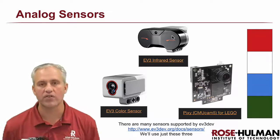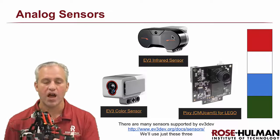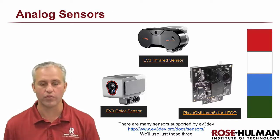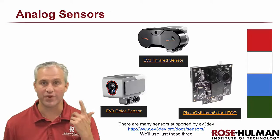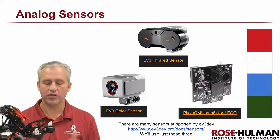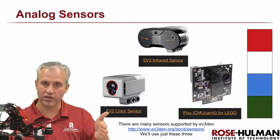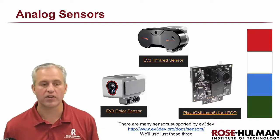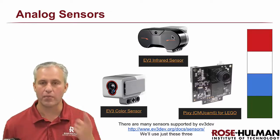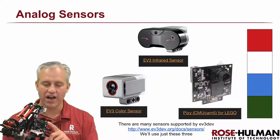The second chunk is going to be about the infrared sensor, which is here on the front. You've actually used the infrared sensor already with the remote control, but you've used it in digital ways — like zero or one values. As you can see by the title of this unit, we'll also look at using it in analog ways: it can be used to detect how far things are away, functioning as a proximity sensor.